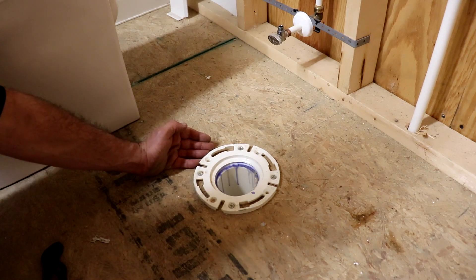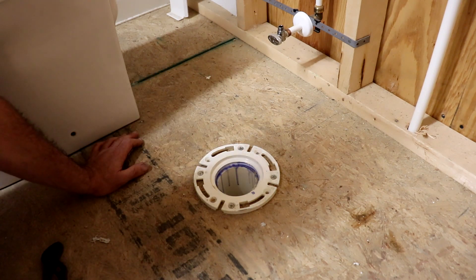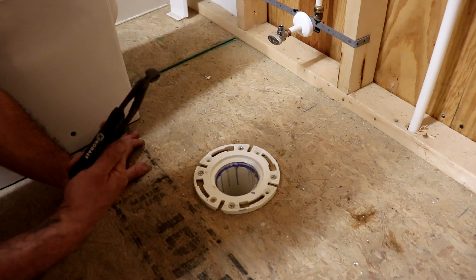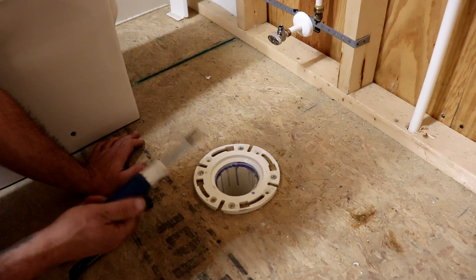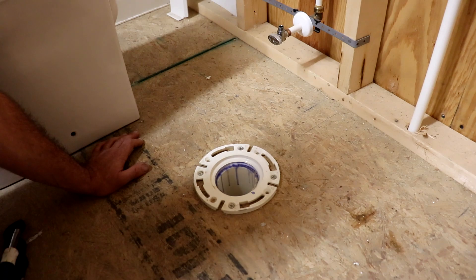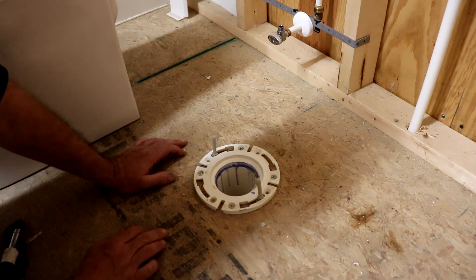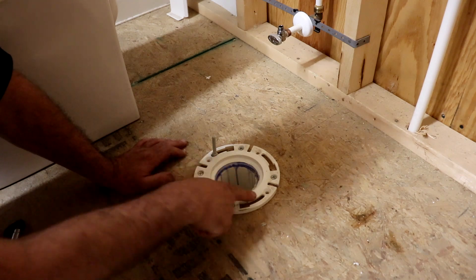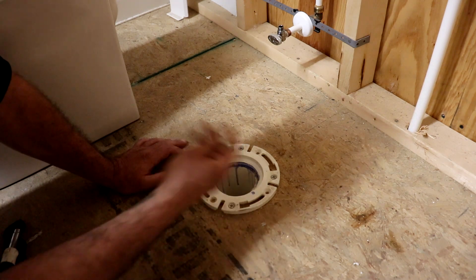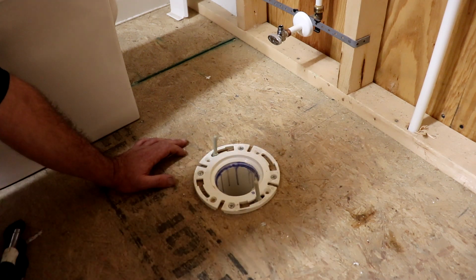Let's get started. We've got our basic closet flange — toilet flange — here. Now if this was new construction, there'd be a knockout ring in here and you'd have to tap on that and pull it out with pliers, but this toilet's already been set, so the flange has already been knocked out for us. To do this job you're going to need some slip joint pliers — we call them channel locks, it's a brand name — and a screwdriver. I recommend the 6-in-1s because it's got everything on it. We'll take our closet bolts and go ahead and put those in our slots. Some plumbers will line them up exactly on the side tabs, but we like to use the slotted joints so we can turn the toilet and move it around a bit to make it look good at trim.